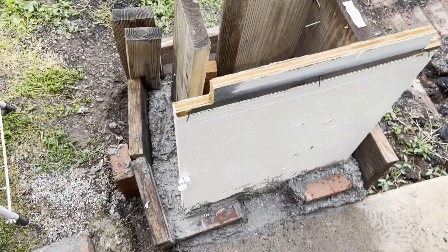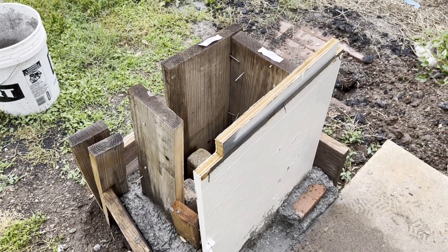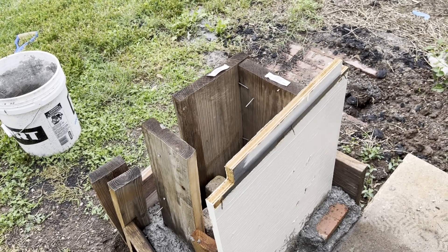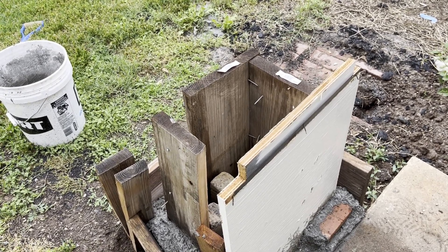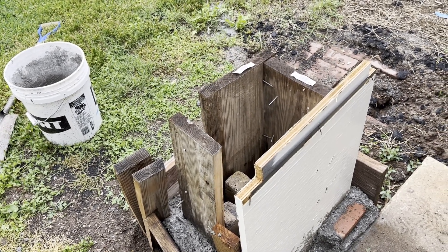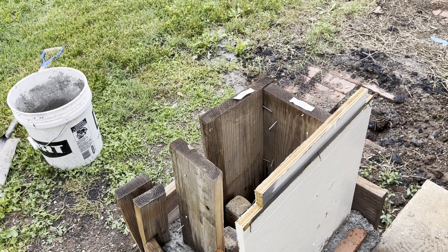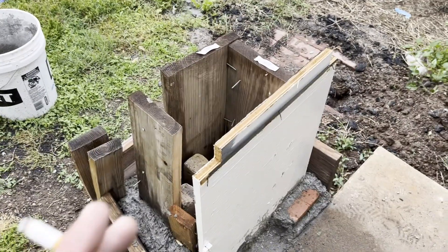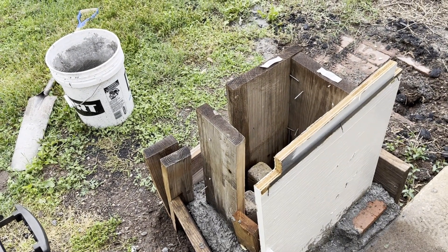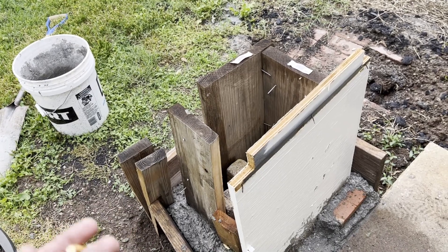What we're doing here basically is I'm going to make a rudimentary heat treating oven — it's going to be more along the lines of a gas forge. I don't really plan on doing any forging with it; I'm just going to use propane as the fuel. This is specifically going to be used for carburizing mild steel using crushed-up charcoal or Kasenit in a container.